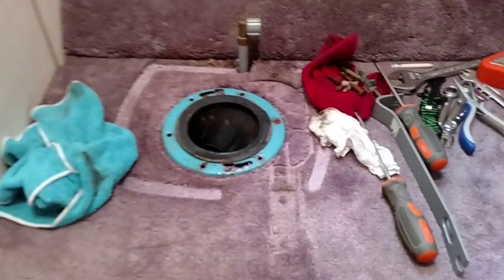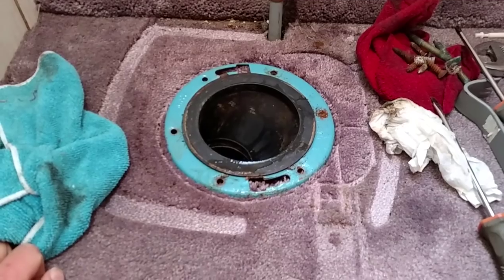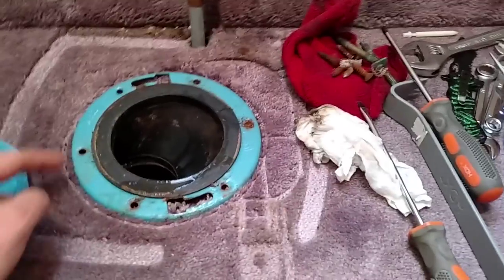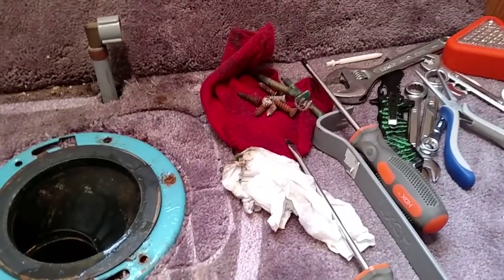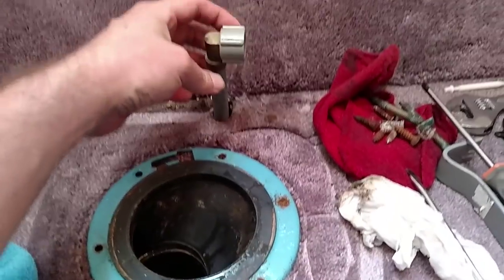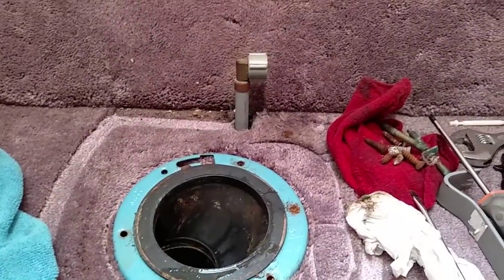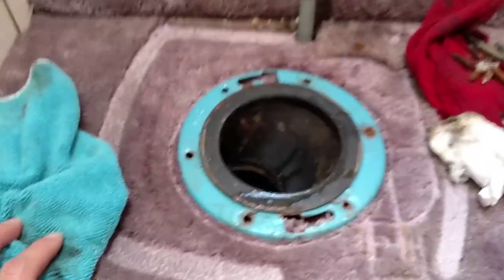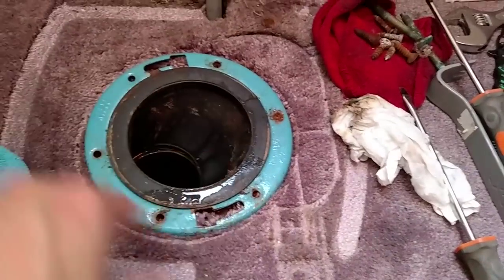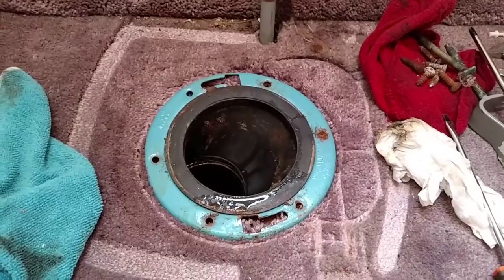The toilet is gone. What we have left is the old seal and bracket. For the new toilet, that bracket has to be rotated because the screws are going to be on the sides. We took the screws out and they're all kind of rusted and rotted, so we're going to replace those. Get your rags ready for the water line back here — when you take it off there'll probably be a little bit of water left. We'll clean it up and find some new screws, and then hopefully it goes on easier than the old one came off.